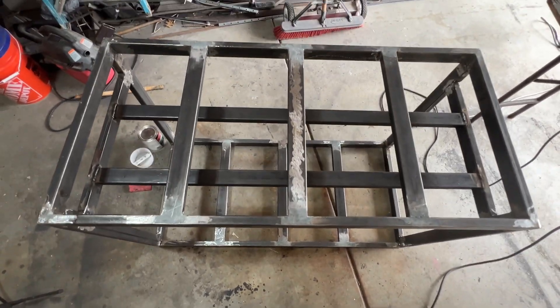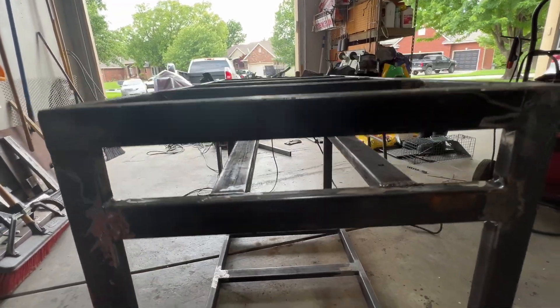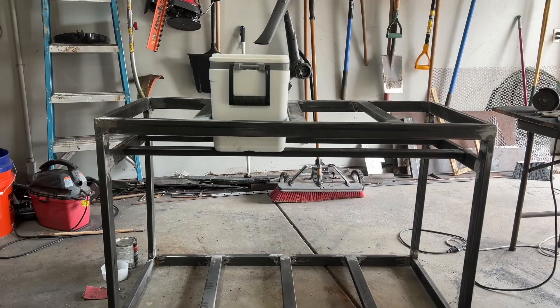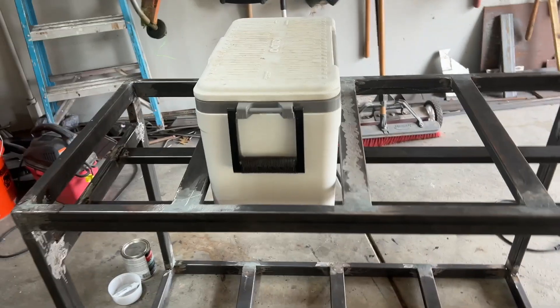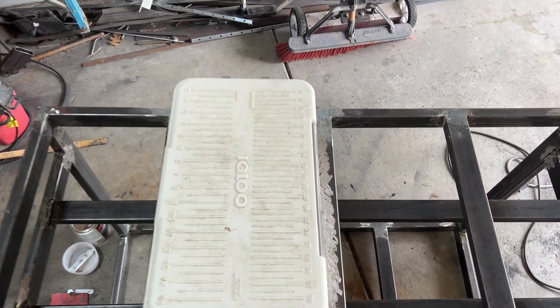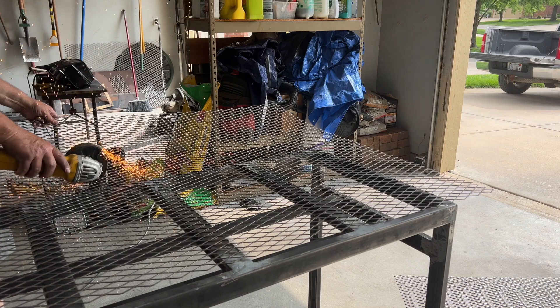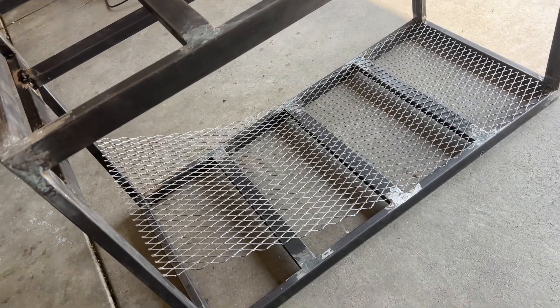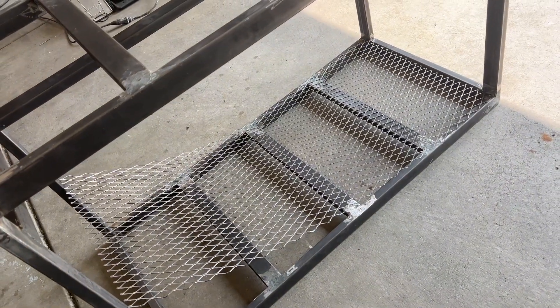These coolers — I'll put a link below — are working great. The ice will melt over eight hours, say noon to eight, but the next morning or the next afternoon the water in there will still be ice cold, so you just add a little more ice. Once I got the top frame done — the box, whatever you want to call it — I made a mirror of that for the bottom, put legs on it, then took expanded steel, flipped it over, measured the bottom, did a rough cut then a final cut to fit it in there. I made sure to weld all the open or cut areas, ground those off, then flipped the cart over, cut a steel plate, and welded that to the frame.